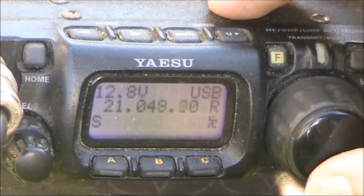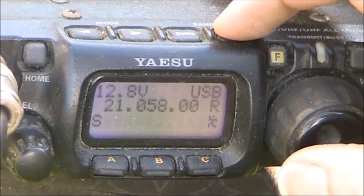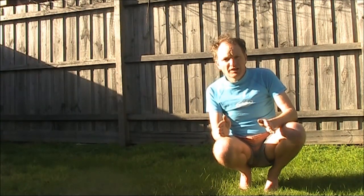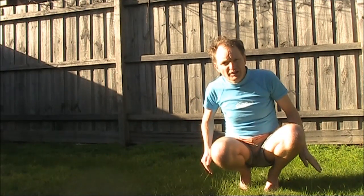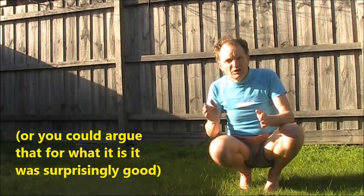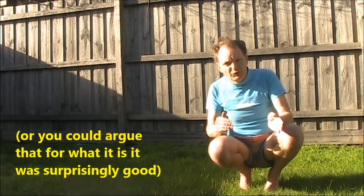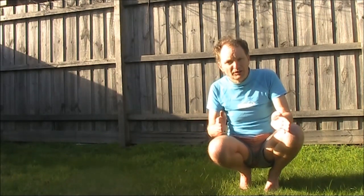With these antennas, other people have found that they are really only useful for lower HF bands. To summarise, I didn't encounter any case where I had a better signal to noise ratio with the loop of wire along the ground compared to my higher and noisier outdoor antenna. But this is only a particular time of day and for particular paths — your results may be different. If you've tried this type of antenna, and there are quite a few people who have, then let me know in the comments below how you got on.